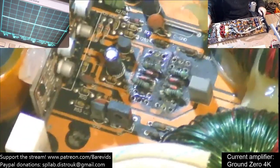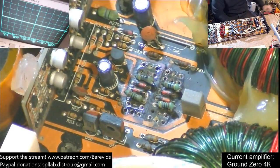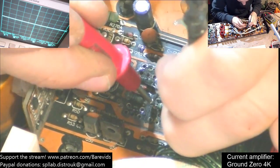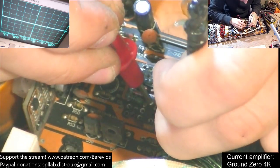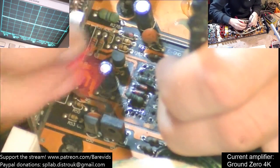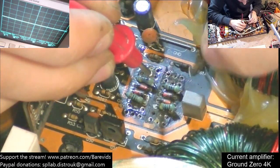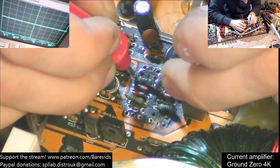The drivers are removed and it's still a mess on the top. I'm going to check whether these resistors survived - I think they look in bad condition but it's just where they were covered in soot from the transistors going down. From memory these should be a low value. These look like pull-downs so they'll be high value - purple and yellow, so we should have 470 ohms. These are 470 ohm pull-downs, so I'm just making sure they're all around about the 470 mark.